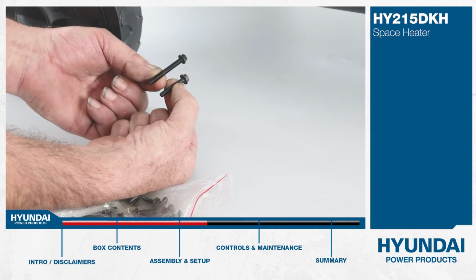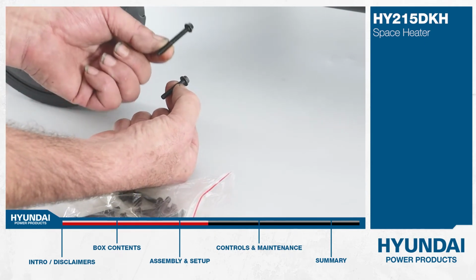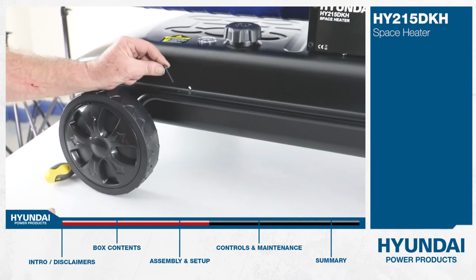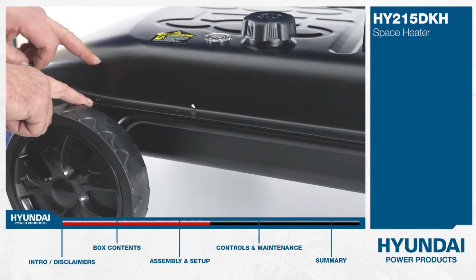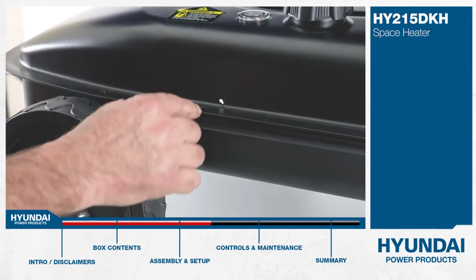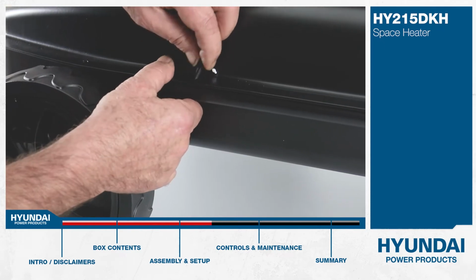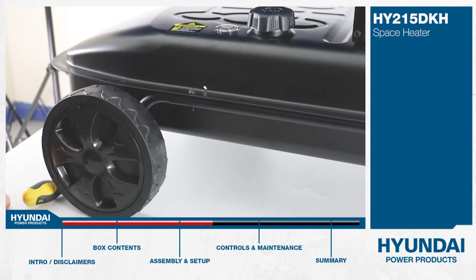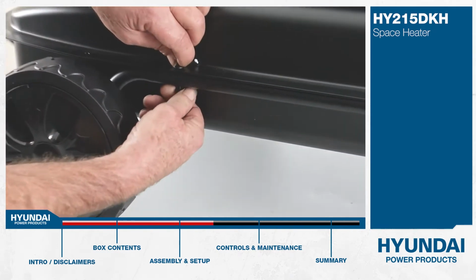So in the bag of fasteners you'll see that we've got long screws and short screws. There are two long screws. We'll come to those long ones a little later. I'm going to take the short screws. There's a hole here on the very end of the tank which we're not using. The next hole back has to line up with this hole in the frame here. So I can just about see it. And I'll just place a bolt in that hole. And very loosely put a nut on the underside.